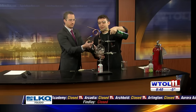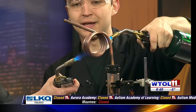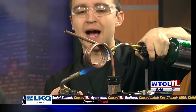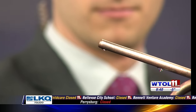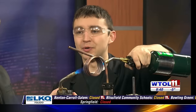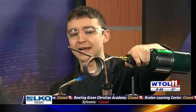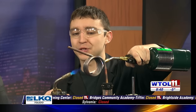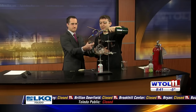Fire it up! Some of the water collected in the bottom is going to squirt out, but that's pretty normal. What we're trying to do is get the steam hotter and hotter — beyond 212 degrees Fahrenheit — because we want it superheated. How we'll know it's superheated is that the steam will no longer be visible. You see how it's getting clearer and clearer? Now this is the dangerous part, because you can't really see it, but it's actually the most dangerous portion.